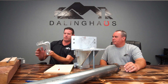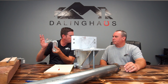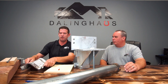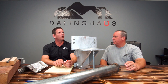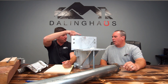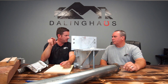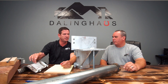This bracket is made by Simpson Strong-Tie. You bolt it to the mud sill and then it gets bolted into the foundation, which on a lot of older homes is not already bolted. We install these every six feet around the whole perimeter. So if a house has 200 feet of perimeter, you divide by six to get the number of UFP-10 plates needed.